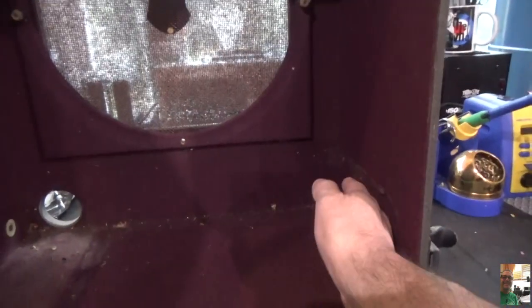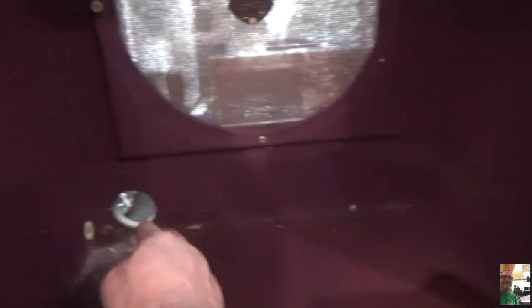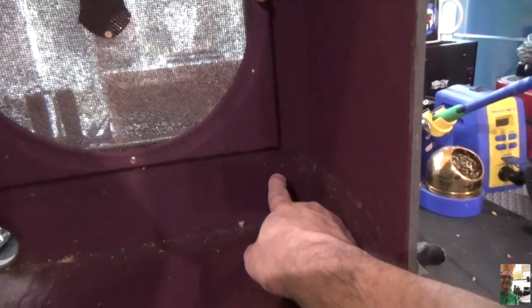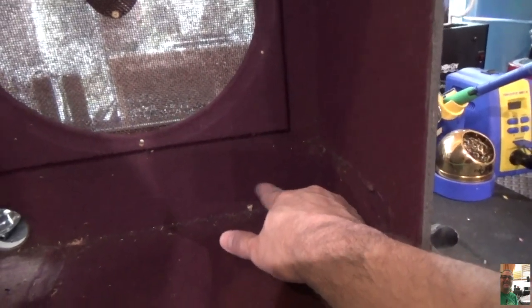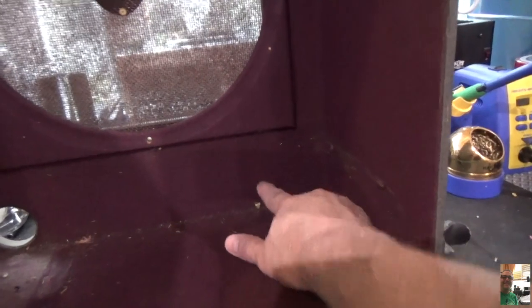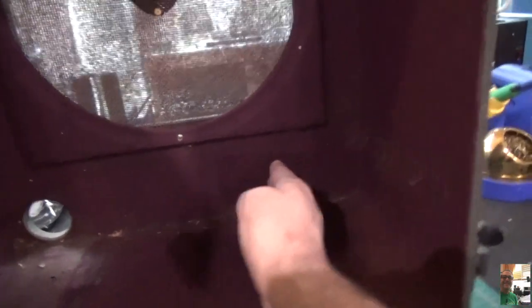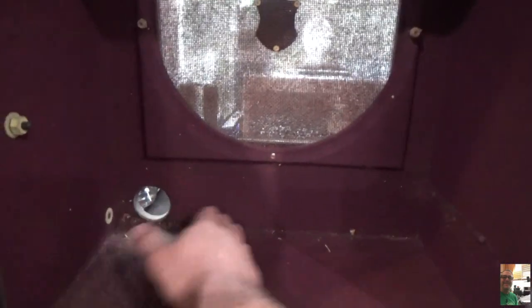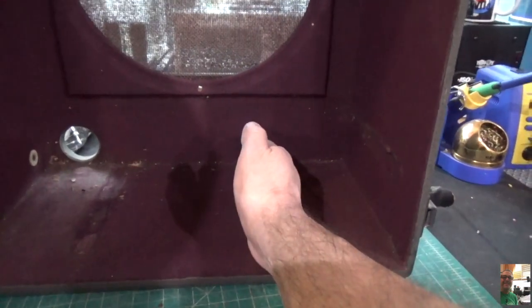All the power is going to be on this side of the cabinet. This is going to be the transformer, all that stuff, because I'm going to keep it away from the input side. So it just makes sense that the pilot light would go somewhere here, and our on-off volume would go somewhere in this area, in this power section. Right? I do plan on keeping the power section right about here, and leaving all of this real estate here for signal. Gives me plenty of room.